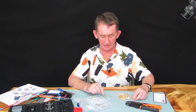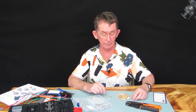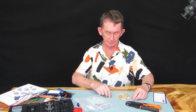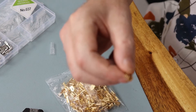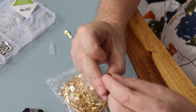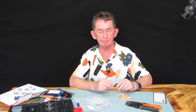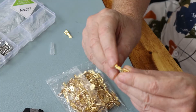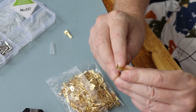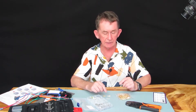Hello and welcome back to Irish Chippy Channel, my name is Pascal. Today I am going to do another crimping video on what you would call open crimping. An open crimp is like this — rather than a barrel where the crimps are already closed, open crimping will have a strap that holds around the insulation, and this one here goes along the wire. For that you need a special tool with a different die.